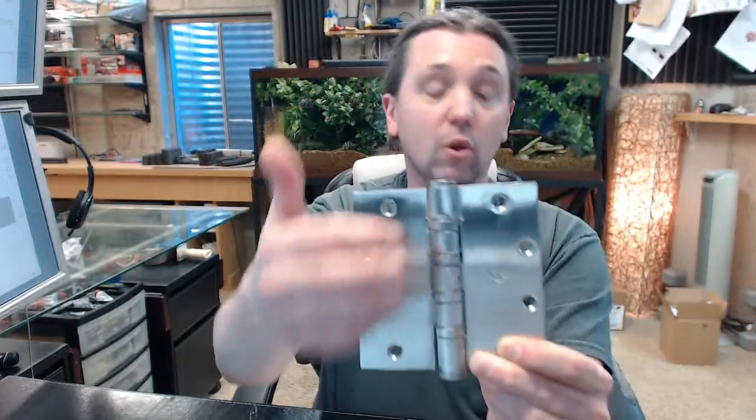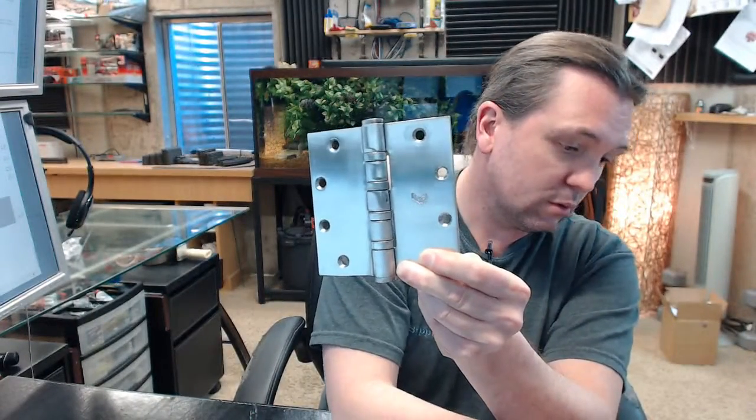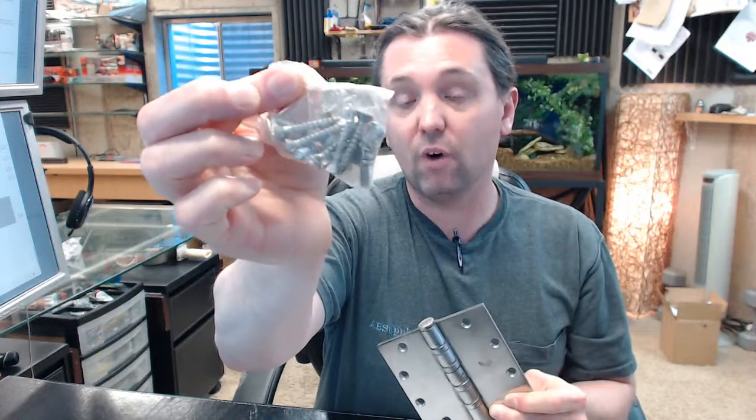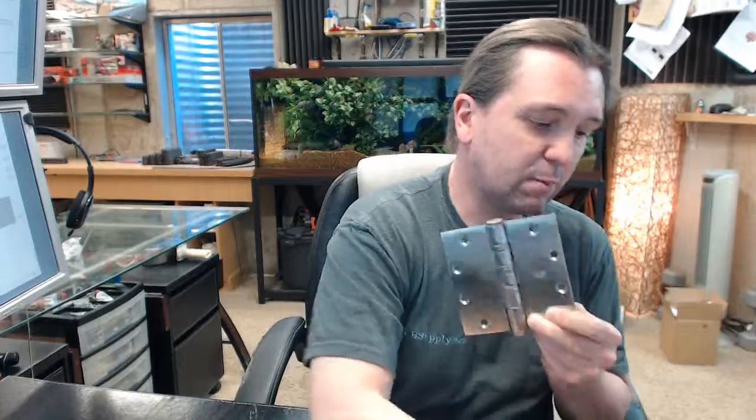Template pattern is referred to because for a 5-inch hinge, the location of these screw holes is considered standard, or what we call template. Speaking of those holes, screws are included. You'll have all machine screws for sure, and typically half wood screws, and they are stainless base material as well. There is a link below this video to a document called Template, which gives you all of the important dimensional properties as seen this way in terms of the location of the screw holes.